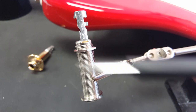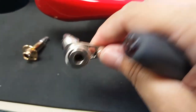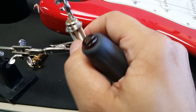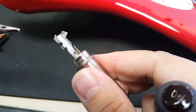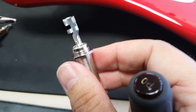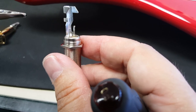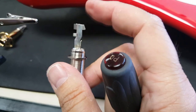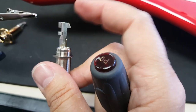What about an output jack like this, where you can't see inside of it? It's very confusing — you can't see where the pieces of metal touch the cable, so you can't figure out which terminals go where. And believe it or not, they expect you to buy this without instructions. You can do some googling if you want, but here's the easiest way to understand it. Keep in mind, there's always going to be a hot and a ground. This one has three terminals, which we know will be one hot and two grounds. The longest one, the furthest away, will always be a ground — so this piece is a ground. You would solder your wire to this ground.